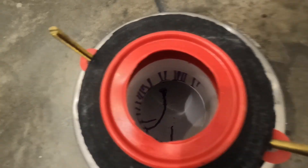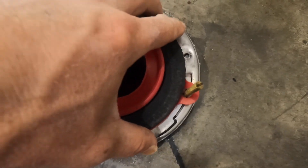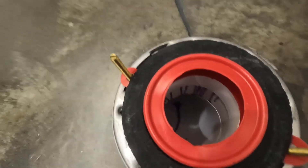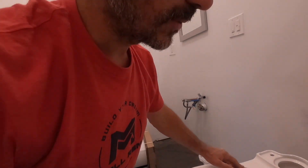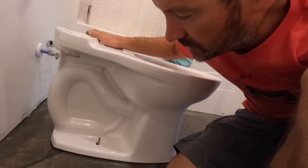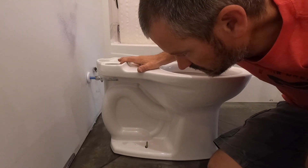When you sit your toilet on there you're going to feel if it can squeeze the ring down or if there isn't contact, so you'll know what you need to use. It's got clips that fit over each of the bolts to hold it in place — just want to make sure these are across from each other. I can tell that's the right size ring because when I set the toilet on there it holds it up just a little bit — you can see it kind of rocks — but when I tighten these bolts down, that'll suck it down and we'll get a nice tight seal.